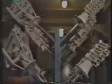But even this is not enough to withstand the high temperatures of casting. So after drying for 24 hours, the mold is placed on this automatic machine and the coating process is repeated. The molds are dried by passing them through an ammonia vapor. Then they'll be ready for de-waxing.